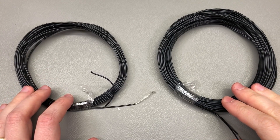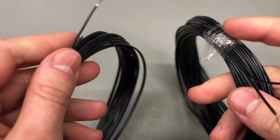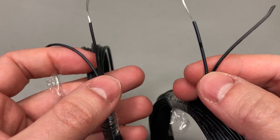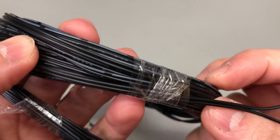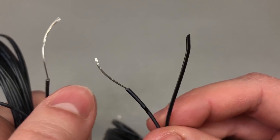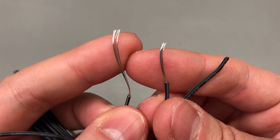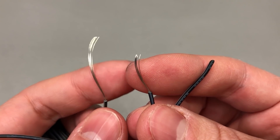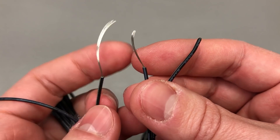Next up, I got some 24 AWG and 26 AWG two-wire PVC cable, which I plan to use for powering LED tape. It's fairly average quality — the PVC insulation feels kind of hard. I've stripped some insulation away to take a closer look at the copper strands, and I'm also going to do a flame test to figure out if there is real copper inside.